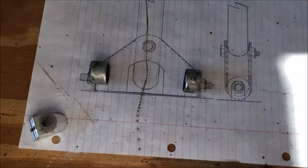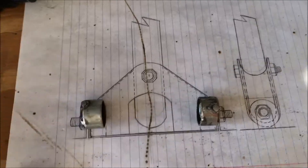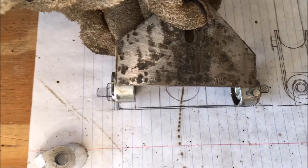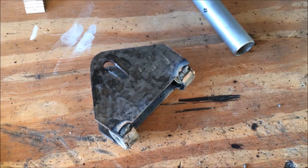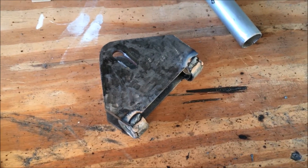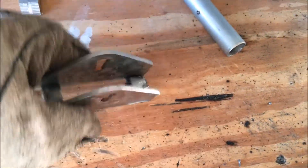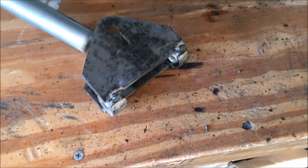Now that I have both pieces with the side washers and nuts spot-welded on, these plates are going to sit on top and get welded together, making up a steering flange. This is a great moment — I can't tell you how happy I am right now. Both ends are on, it's solid. When it's sitting on the trike it'll go left and right, and then the steering column inside will be able to rotate forward and back. That is really exciting.